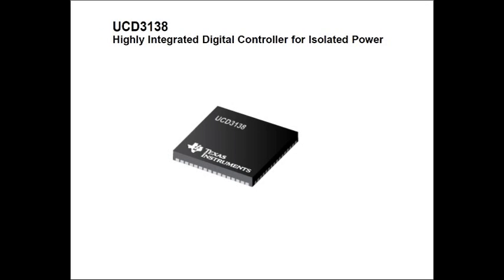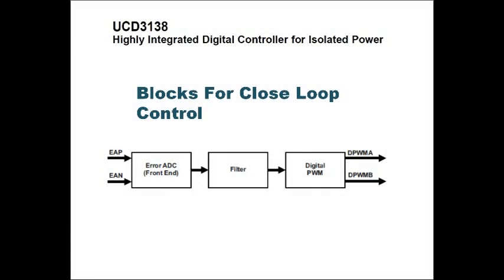So what makes this part cool? My belief is that it removes some of the hard work of developing closed-loop control by making all the key building blocks available in hardware to be configured very easily. By implementing these blocks in hardware, it reduces the timing it takes to do each calculation and allows you to close loops at a much higher rate, meaning you're actually able to close loops at the PWM frequency.